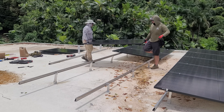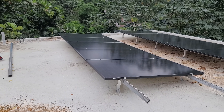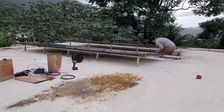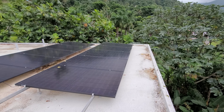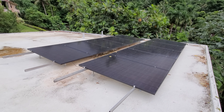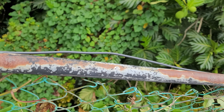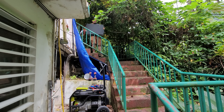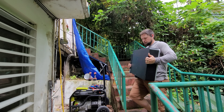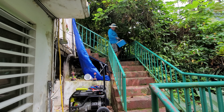The solar panels are finally installed, mounted, and ready, but big clouds were coming so we couldn't finish wiring in one day — we came back the next day to finish up. We really should have wired as we were putting panels on, but we wanted to get ahead of the rain. After everything's wired, one cable connects the front row to the back row to continue the series connection. Because this is a simple off-grid install, we run wires along the fence on the main balcony where wires already exist. Before coming to Puerto Rico, I pre-added the battery cables, solar cables, and split-phase outlets to the 6000 XP inverter so we wouldn't have to worry about it on-site.